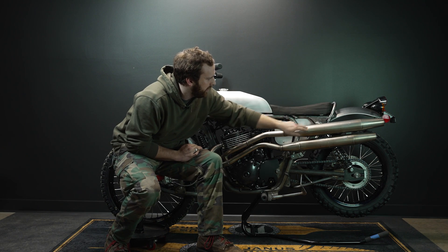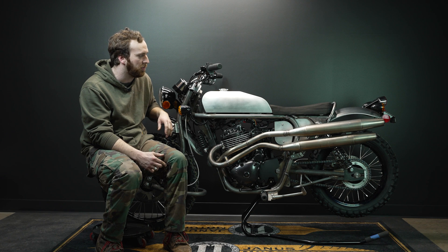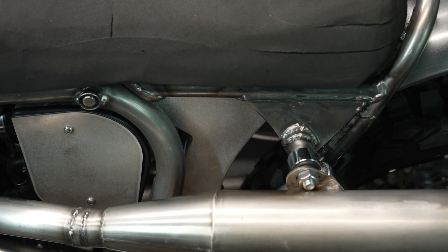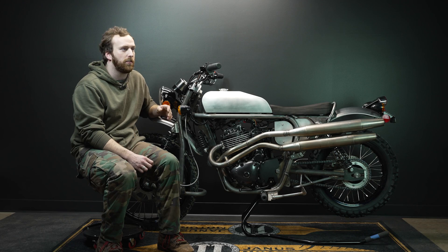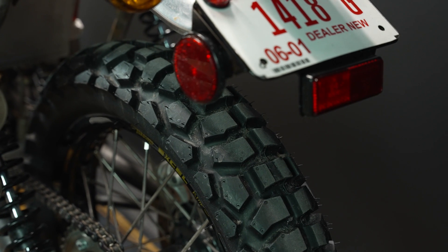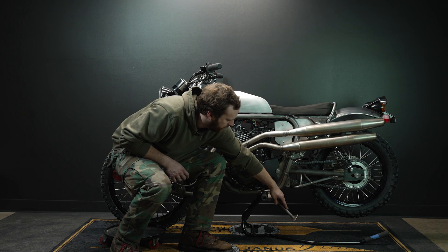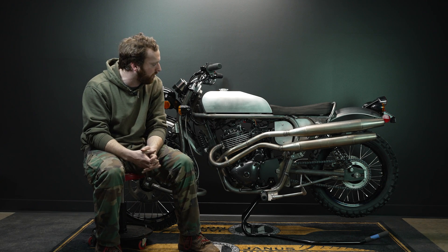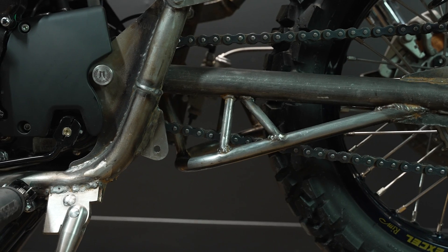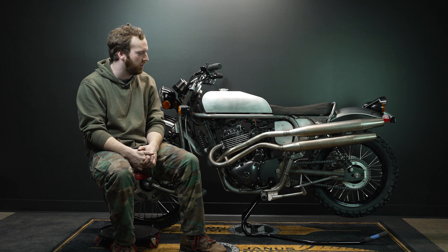The exhaust is a pretty tricky thing to get both tubes wrapped around the engine and up on one side for the high side. The oil tank is also really crammed in there — this area of the bike is the most parts-dense, with a lot going on. Getting the oil tank crammed underneath the seat has been a bit of a challenge. We're also going to struggle with suspension geometry changes to get more travel out of the front and rear, but that's just going to take a lot of trial and error — put on new shocks, ride the bike, see how it feels. The side stand is a prototype I machined out of stainless steel, beefed up to be smoother and longer lasting. The swing arm is pretty spectacular — the support underneath is asymmetric and the chain passes through it. It's very much overbuilt, but we'll start with that for the concept bike and pare it back for the production version.